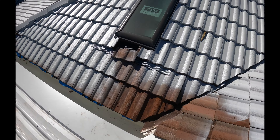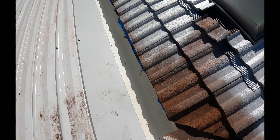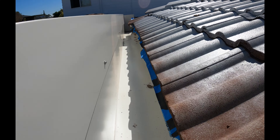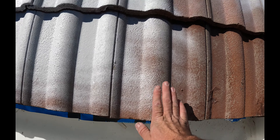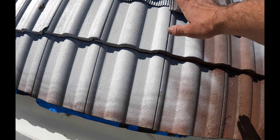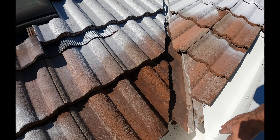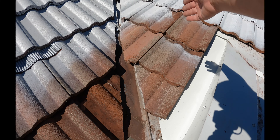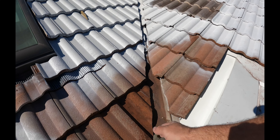That tile sits on there, and then as we come down here, this is the box gutter — she's pretty large. It does the same thing: it comes up and then goes under and then has a lip on it, mostly up the full tile. Then we've put another piece just on there which catches everything — that goes in under half the tile, has another lip, and then joins up with that valley. Got all the barge capping, I believe it's called. All of this was done by an actual plumber.